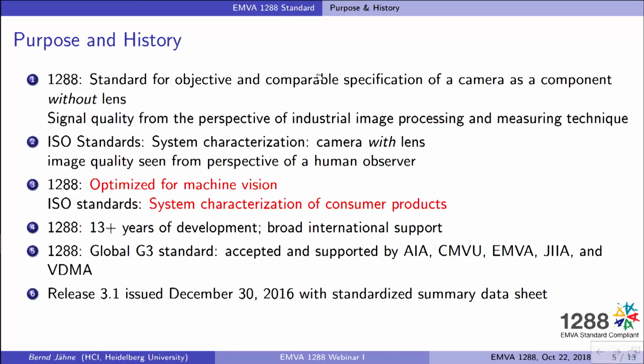And finally, we obviously have a clear limitation: what is the maximum exposure time we can take with a camera, because if we have only long enough exposure times, we will saturate our image also just with what's called the dark current. So these 3 things have to be discussed in detail, and we will start with that in our next webinar.